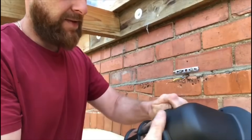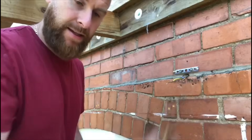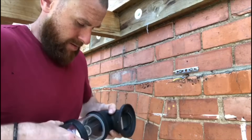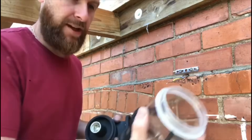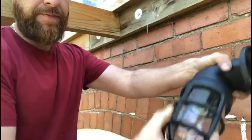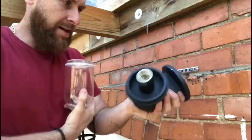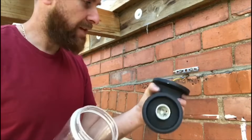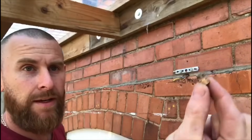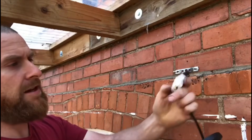Next, with the lamp, we'll drop the nut — careful not to drop it. We'll take out the two little brass screws and remove the lamp. It actually unscrews rather than just popping out — it screws in like that and the cover goes over it. So we unscrew that, remove it, and that comes apart. If we drop the cover while fitting, we won't damage the glass. Now we've got this — if we look inside, we have the terminations all within here.